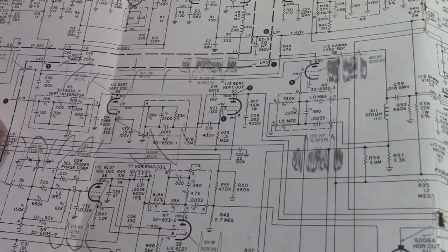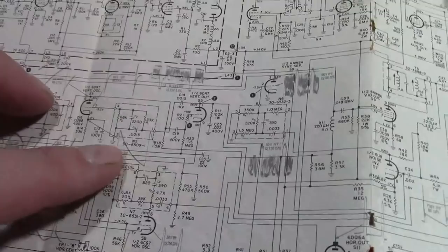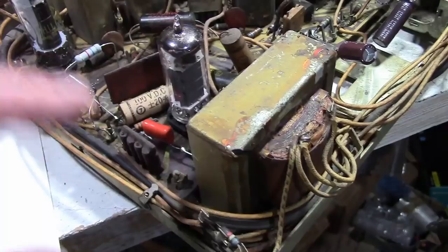What the vertical integrator does is synchronize the oscillator to the incoming sync pulses. Without it present, I'm pretty sure this will just freely oscillate on its own and deflect the yoke. I checked the primary and secondary DC resistance - seems to be fine. I have not checked the vertical yoke windings, but I can certainly also check that. The easiest first step is to put the socket extender in and get a scope on pin 6 to see if this thing is oscillating.